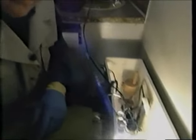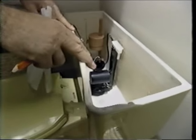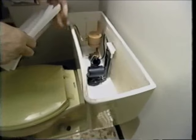So I'll just turn the bulb on. Now that will stay on for 12 hours. Then we'll come back and proceed into adding the adhesive and putting the foam in place, insulating the tank and stopping that condensation. Now that 12 hours has passed, the inside of the tank is really nice and dry, and that's very important for the adhesion to take place with the foam.